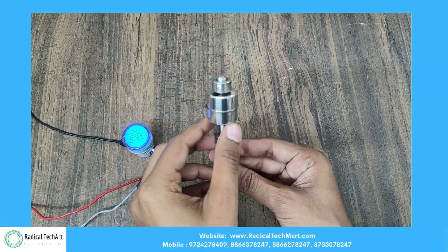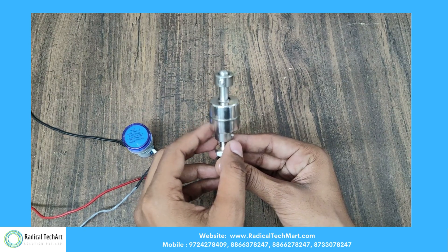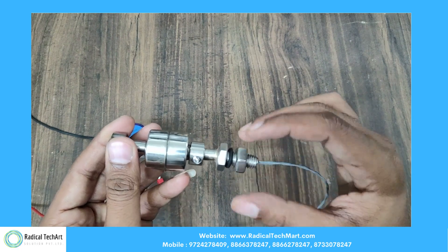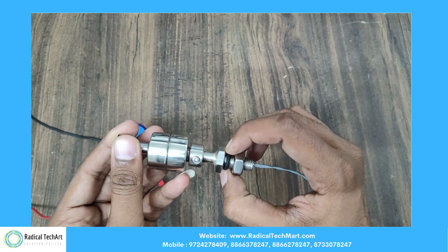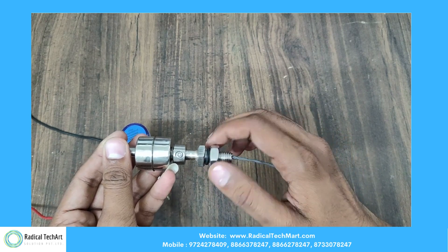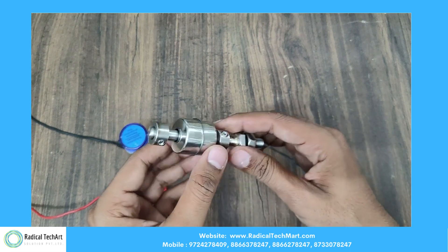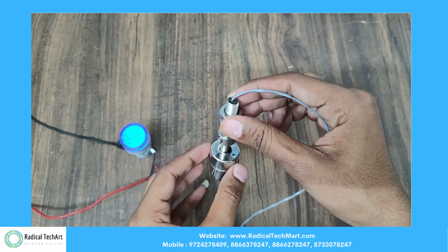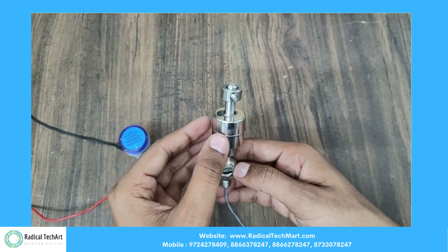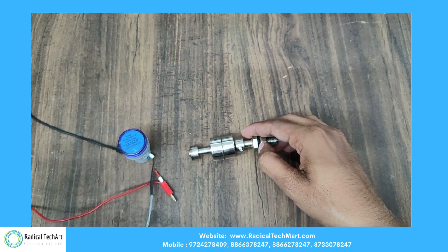Here is the working of this top-mounted magnetic level switch. Here we can see our top-mounted float valve with the indicator. Basically, when the liquid touches the level switch, it outputs a signal to keep the liquid from overflowing the tank. On the other hand, when the liquid level drops as the liquid is discharged, a level switch is used to prevent completely draining the tank. This is referred to as an empty detection or lower limit detection.